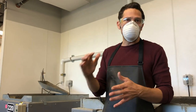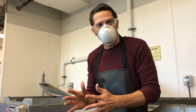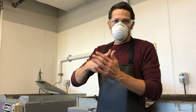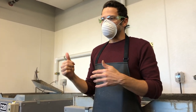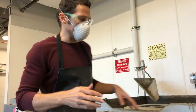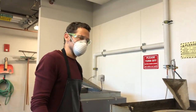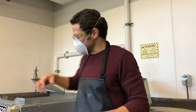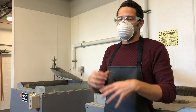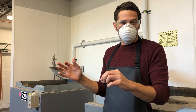The reason for fewer steps is simple. These tools are very hard — a piece of steel with very hard grit grinding on a hard piece of glass is a very aggressive tool. Whereas the belt sander is soft, flexible, and malleable around the surface of the glass. On the belt sander you need more intermediary steps to work your way closer to polish. On these flatbed grinders we can effectively remove the 80 grit surface with the 220 because it's such an aggressive tool. Some places only have one rough grinding 80 grit wheel and everything else is done using hand lapping, which will be covered in a separate video.